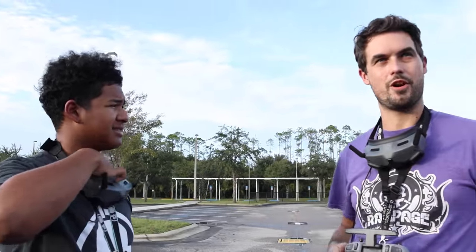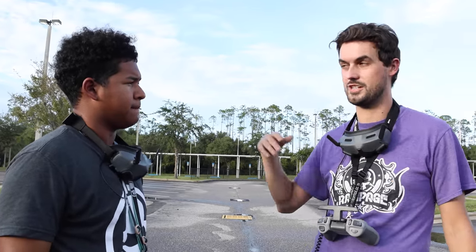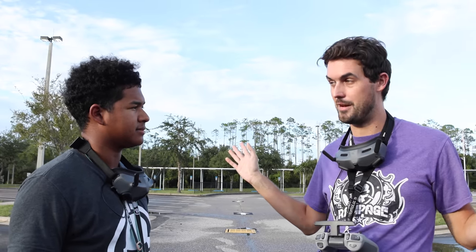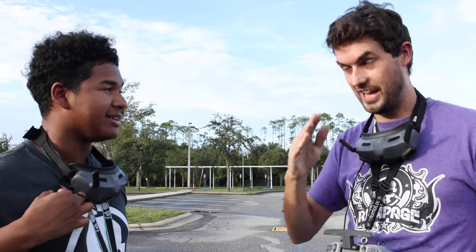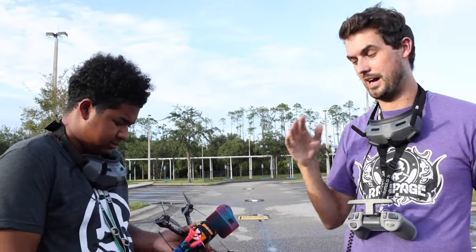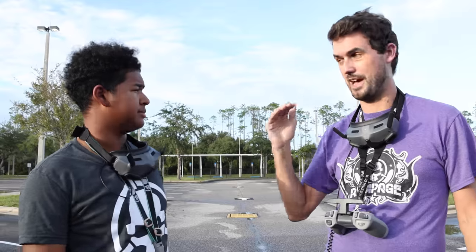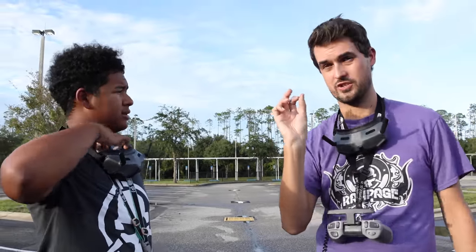But my concern is if you're on the auto mode and you're flying with systems that don't talk to this system, like analog or a different HD system, like Avatar or something like that, the DJI is just gonna spam everyone. I mean, that's using the whole bandwidth. It's on all the channels. Oh, it's literally, that's what that means. When it's got that wide of a band, you're using the entire 5.8 band. So basically, if you end up flying with other pilots that aren't on this newest DJI system, be courteous, go in, lower the bandwidth probably all the way down to 10 so that you are on like a single traditional channel so that more people can fly.